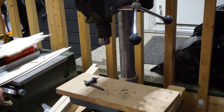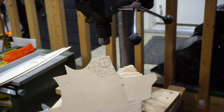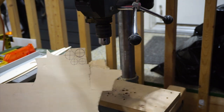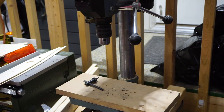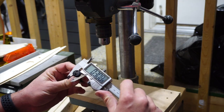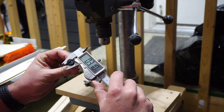I'm going to drill the holes first because it's much easier to drill when you're holding a sheet of wood versus trying to hold each small individual cutout. I'll drill them all to the same size. To get really accurate drilling, use calipers to measure — that bolt is 309 thousandths of an inch, about 310.